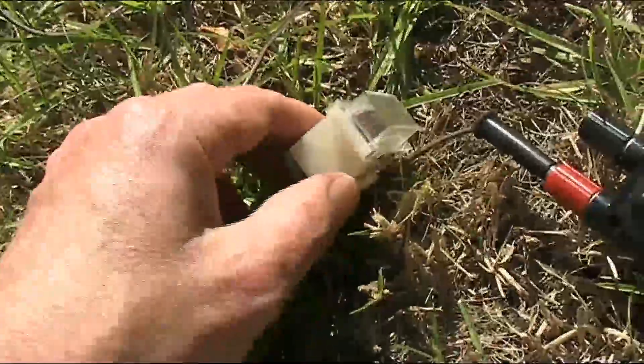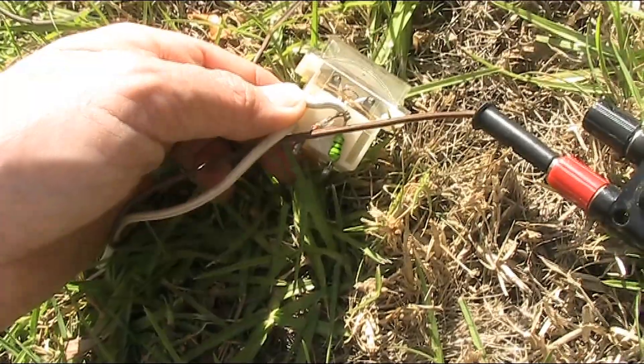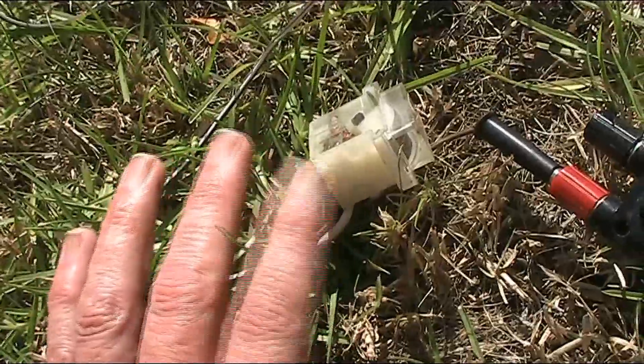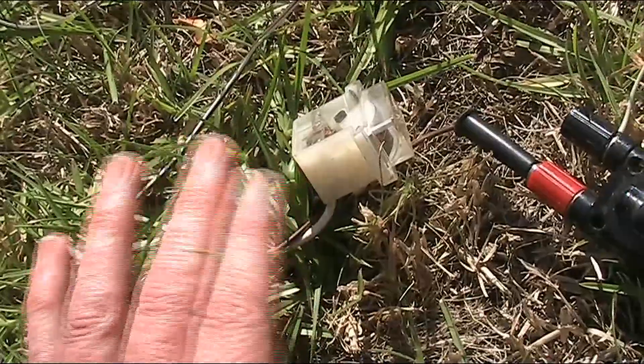The meter itself isn't much — just a moving coil meter, a diode, and an RF choke. You might need a small gain control if you're running more than QRP, or you can just vary the coupling.